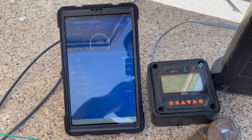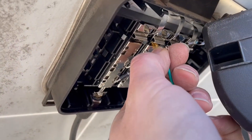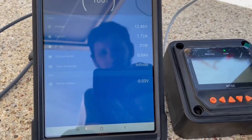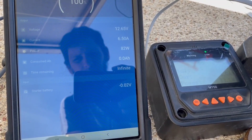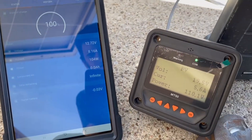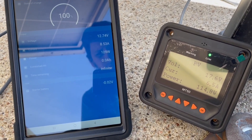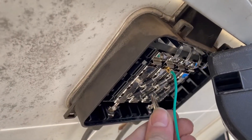Then I tried shorting them out — I stuck this up in here and would short out one column at a time. What happened is the wattage dropped down to about 105-106 watts. What's going on is the solar charge controller is bringing the panel voltage down to about 17 volts instead of being up in the 25-volt range. So we settled in at 108 watts.